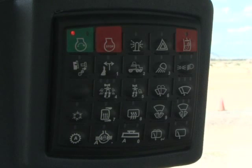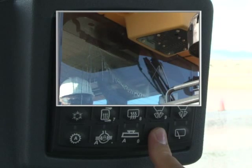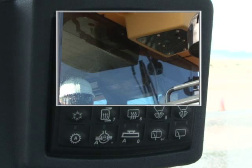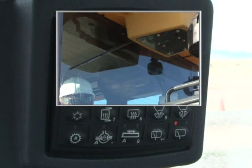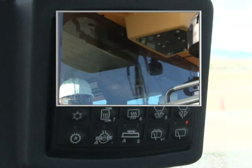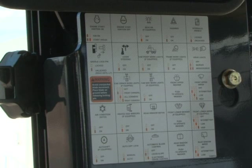The third switch on the bottom is for cross slope, a feature on GP models that automatically controls one side of the blade. With the left LED illuminated, the Deere cross slope system will be activated — details on its use and setup are found in a separate section of this video. If equipped, when the right LED is on, the aftermarket grade control system will be activated. The next switch is the rear wiper washer — push and hold to operate, and the wiper will automatically swipe several cycles. The lower right switch controls the rear wiper: left LED for intermittent mode, right LED for constantly on, and another push turns it off. A reference decal to the right describes each button.